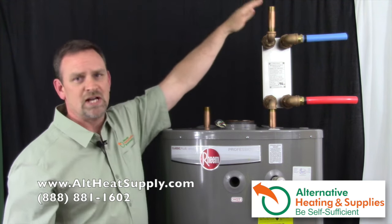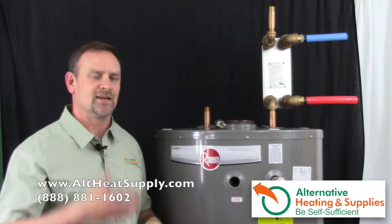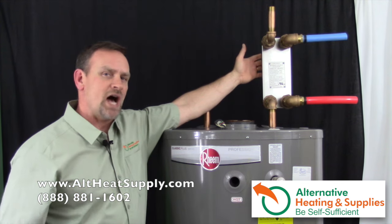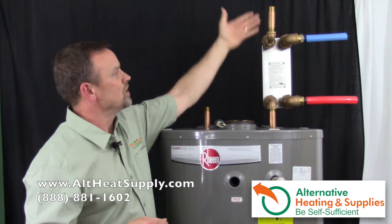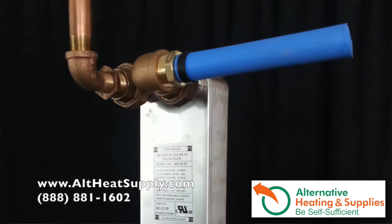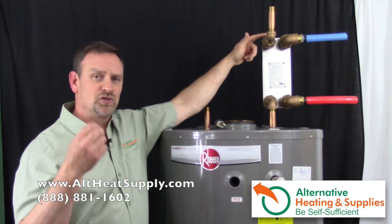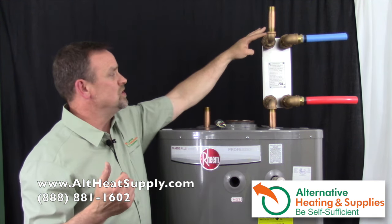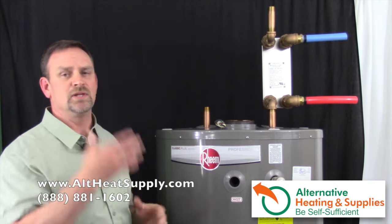This is the cold water side, so cold water coming in. The plate exchanger is already installed here. This is your hot water side. You're going to mount your plate exchanger on the cold water side — I'll explain why in a minute, I call it a thermal pressure siphon. All you're going to do is cut the water line, mount it, do a 90 degree here going into the plate exchanger. I always recommend unions. You've got to use lead-free copper and also brass — I carry lead-free brass. Put a union here, come down through the plate exchanger, then another lead-free union and back into the domestic hot water tank.